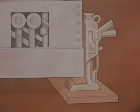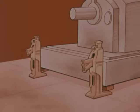Do not place the jack directly on the ground, even if the soil appears firm. The size of the jack base is not sufficient to support the lifting capacity of the jack on the ground. It is important that all jacks be alike with regard to type and capacity. Avoid the use of only one jack; the use of two will make the lift more stable.